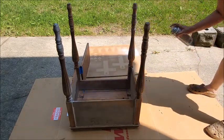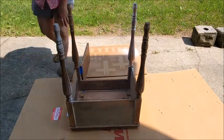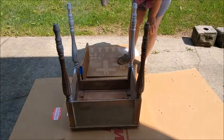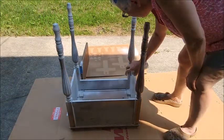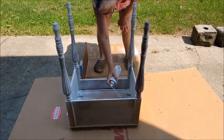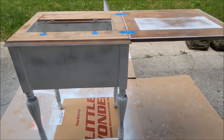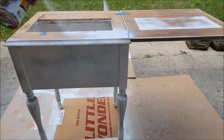Finally we got the Bin Zinsser shellac spray to stop stains and odors from coming out. I had a bit of a can there and thought I was probably going to run out — and I did — so I had to go get a couple different cans, got two just to make sure. Went ahead and sprayed the inside really really good, every inch, then got the outside really really good, every inch. It was drying pretty quickly out there that day — the paint was almost drying in the air before it was getting on the piece. I did have to do some sanding between each coat because I could feel quite a bit of dust on the surface, so I had to knock that off before spraying again.